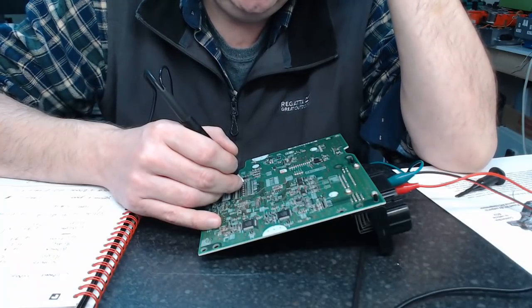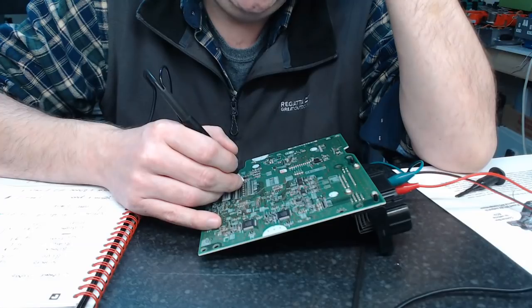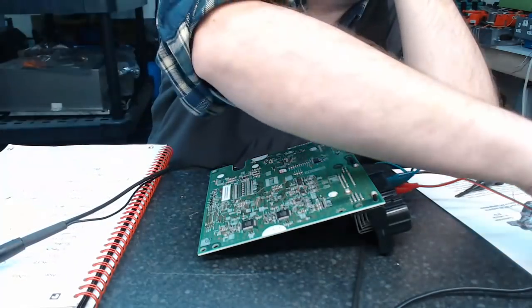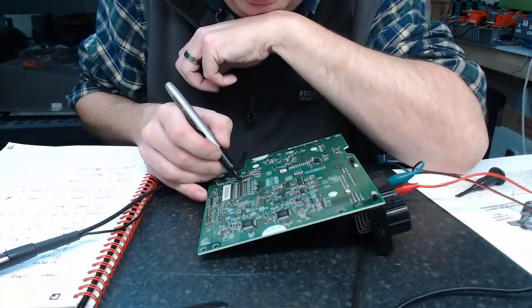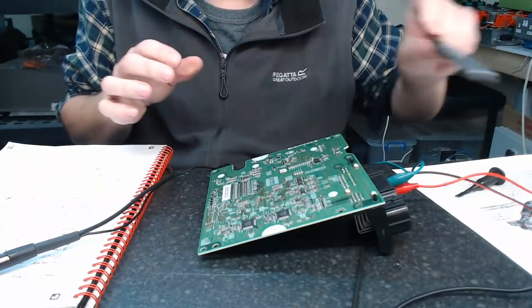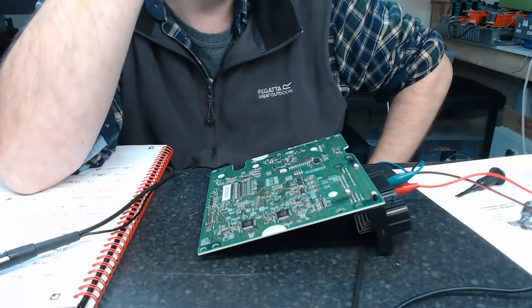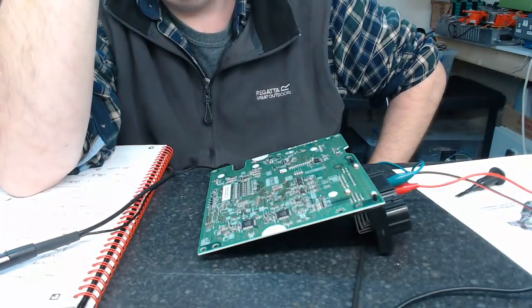Everything down to here, so 1 through 12, are all 5 kilohertz and 50% duty. But down this last one, it's 7.45 kilohertz and about 90% duty on that one, and about 10% duty on this one. This is the booster. I'm just gonna put a little mark on that. That's the booster, guys. They're running it at 7.45 kilohertz. So there's a little bit of something we didn't know last time. That's the booster frequency.